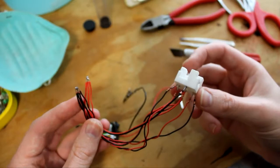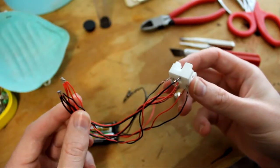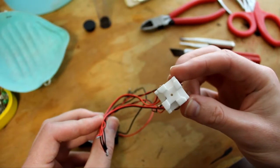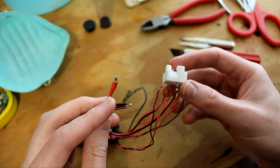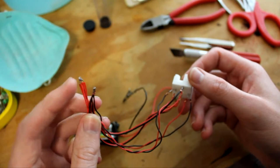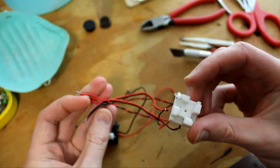Alright, as you can see, I am testing the omnilink to power now. I wired this omnilink jack here for DC power, 4 separate channels. In the actual specification for the omnilink, there are 4 independent channels. For the purpose of this experiment, I've wired them all together, so basically there's just one channel, and you can see clearly that these wires are all soldered together. So these all go to the negative and these all go to the positive contacts.